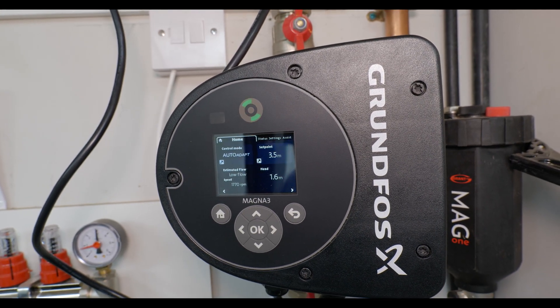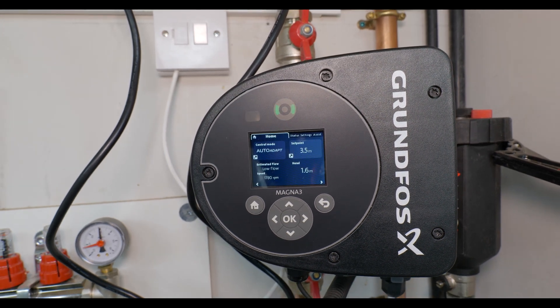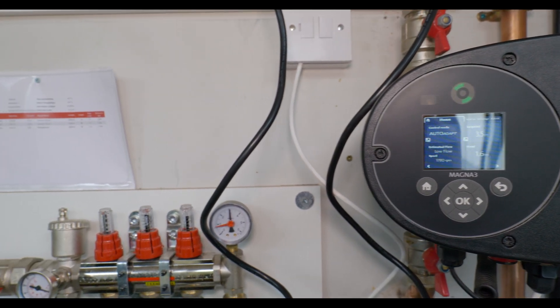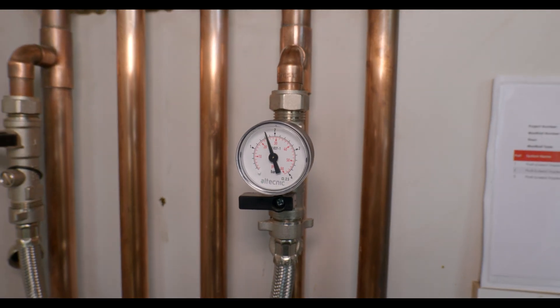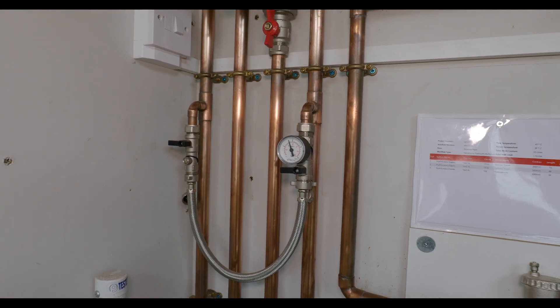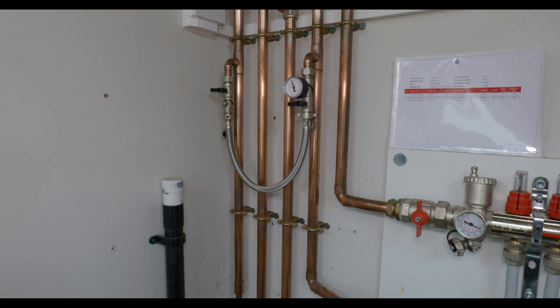The central heating is all full up now and the pump is operational - got it temporarily wired so we can pull heat from the thermal store, and we are starting to get heat coming through, which is excellent. The central heating is full at one and a half bar and we're just purging and balancing the system. It's gone really well - there are some big cast iron radiators in there, so it took a long time to fill up.